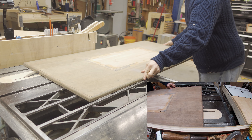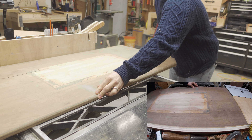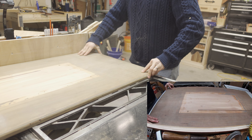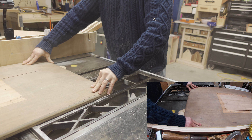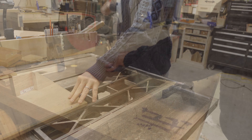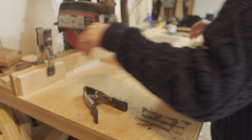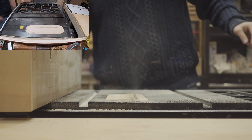To begin, I ripped a quarter sheet of plywood that was acting as the base to my dining room table down to about 12 inches. Due to the time sensitive nature of this project, I didn't take the time to do a whole bunch of different camera angles and talking heads to camera, so this video has a lot more voiceover than my other projects. It was then over to the radial arm saw to cross cut the panel. I cut two sides to 10 inches and two sides to 12 inches — these will form the sides of the box.